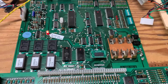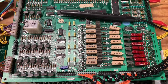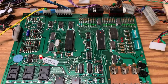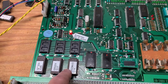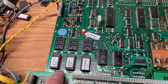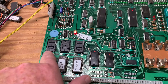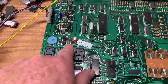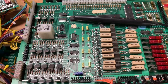This is a Firepower board pair — a System 6 board pair — going into a prototype Firepower that will be available for play at Pinball Expo in a few weeks. I've replaced all the headers all the way around, all the sockets: CPU socket, three ROM sockets, 6810 socket, 5101 socket. I've installed NV RAM, new green ROMs, and the Firepower combo ROM. Using the combo ROM lets you avoid replacing three sockets — procedures are outlined in the Pin Wiki — and part of it is installing two 1N4148 diodes at this location. I've also added a blanking indication, and on the driver board I replaced all the headers.